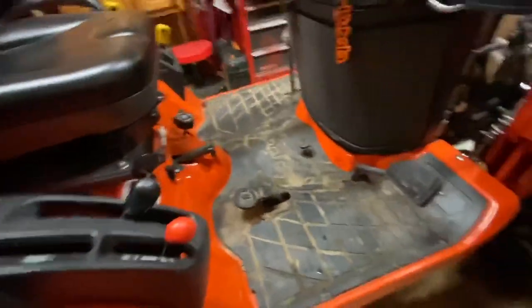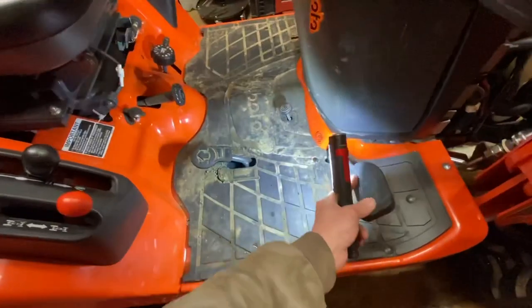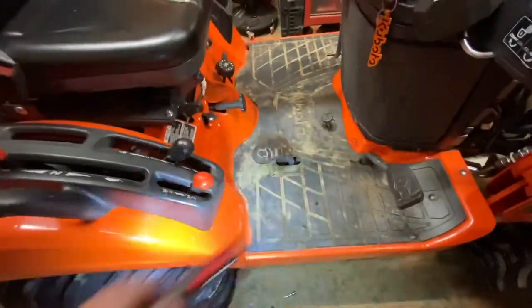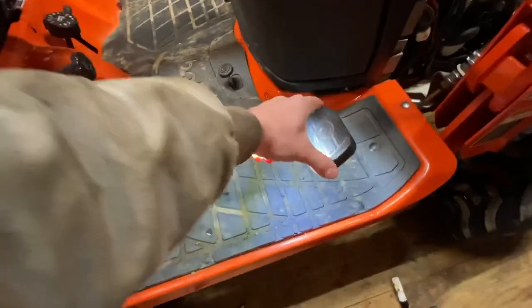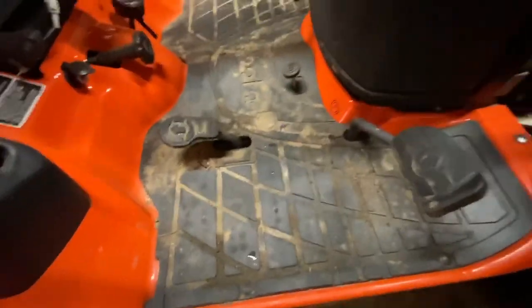At the end you're going to want to grease it, because the more grease you have in there, it's going to limit the amount of slop and play in this pedal and help the side-to-side motion when you pack it with grease. Definitely keep that grease filled at all times — a lot of people forget about it. It's underneath this little flap here. If the side-to-side play gets real out of hand, you're going to have to replace the whole linkage, and that won't be fun or cheap.